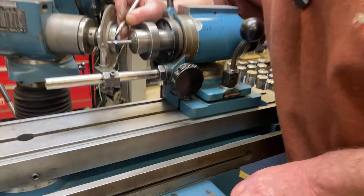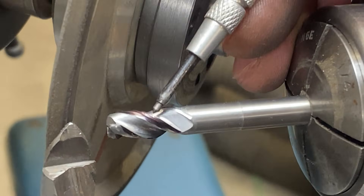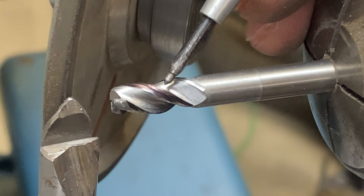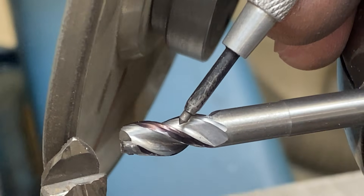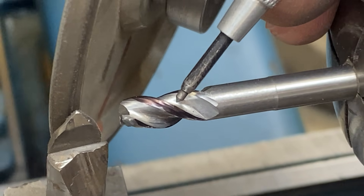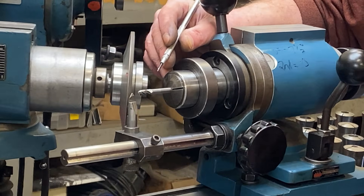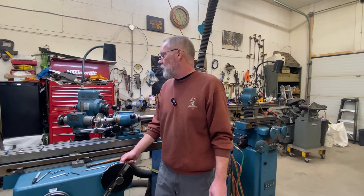I've painted these clearance angles with marker so that I have a hope of being able to see what I'm doing. And if you look right there, you can see I've just scraped the primary clearance angle and I'm pretty much evenly scraping from the leading edge to the trailing edge. We'll take a couple passes, check with the test dial, but that should be very, very close to recreating exactly what primary clearance angle was on there to start with. So we're ready to go now.